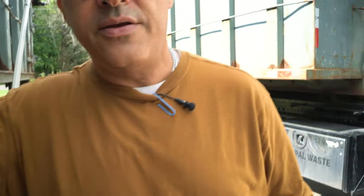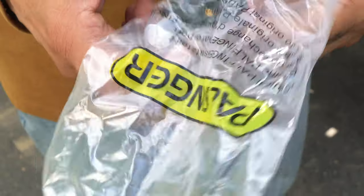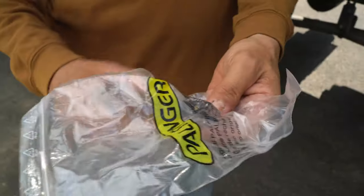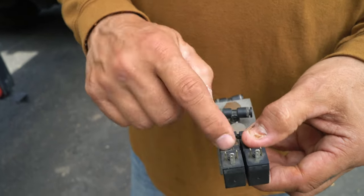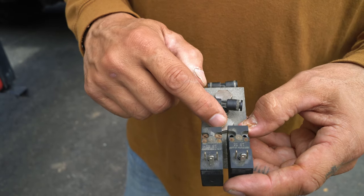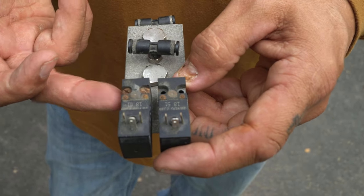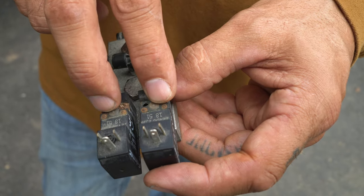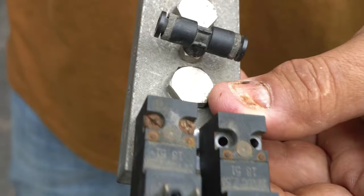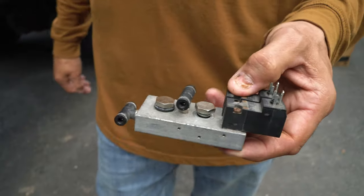I would grab your local Palfinger guy and get some spare washers on hand, or buy the whole unit for $50. That's what I did — when I change the unit, the screws will come out and I'll have new screws too. This washer and the screws are why I bought it, and the block itself will be a bonus. If I get a problem, I'll just replace the whole block. If you're having trouble with up and down or in and out, I would replace both washers, silicone the washer, and replace both control units. That's my opinion — I replaced the whole thing for $250, so now I have replacements for $200 instead of $500. That's my tip of the day.